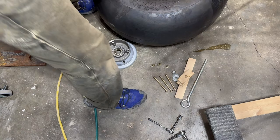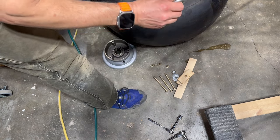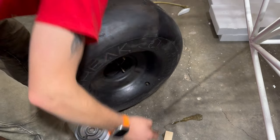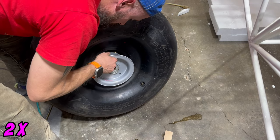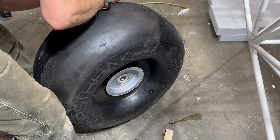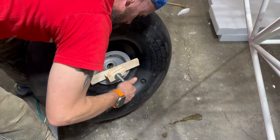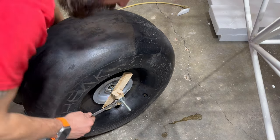The gray ring isn't quite seated yet, but I'll drop this side in, then flip it over. I'm putting two or three bolts in to line them up with the three holes. A bolt goes through the side and grabs the bearing on the other side. Then I put washers and a nut on — this particular nut is three-quarters inch, so I've got a three-quarter wrench — and tighten it to pull the assembly together.